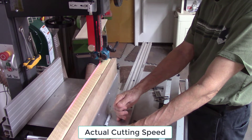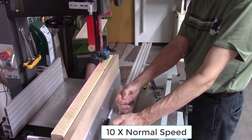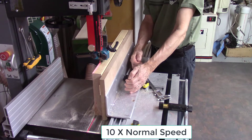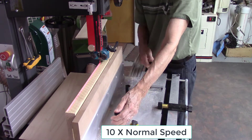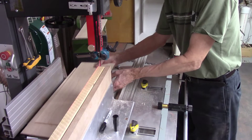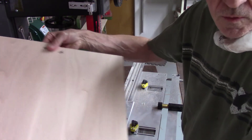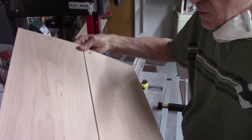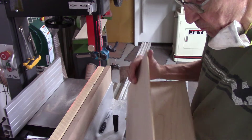By cutting slowly you're also allowing more time for the sawdust to clear from the gullets in the bandsaw blade and prevent gumming up. I've increased the video viewing speed 10 times to reduce your viewing time, but please be aware this is not the actual cutting speed. I used the same procedures to cut a second board to the same 125 thousandths of an inch thick and followed up by cutting the remainder of the board to the same panel sizes. Once again, there's our matched set of maple panels, and the finish is really good.